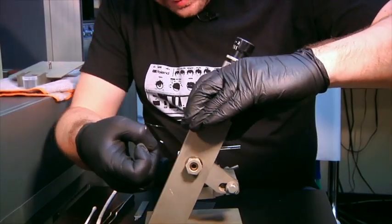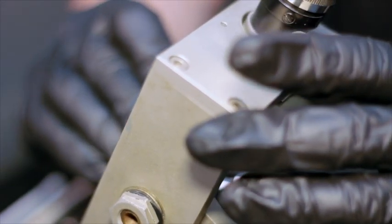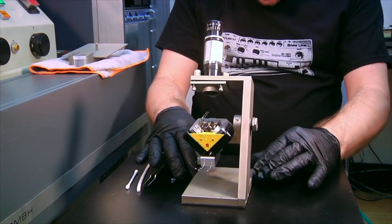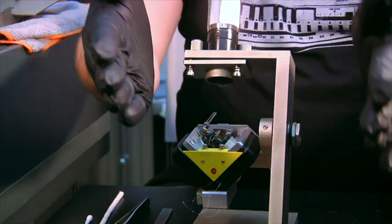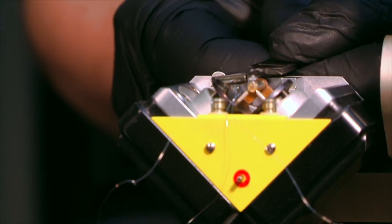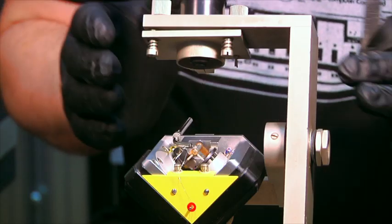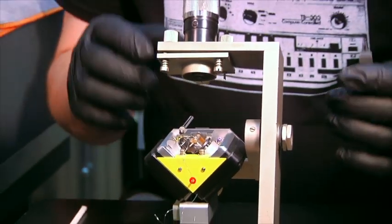On the Neumann, the heating terminals are in front. We're going to take this and just gently insert it into the torque tube. It's just gently seated in there. We're going to use our special tool to work it down in because these shanks have a taper to them — when you settle it in, that's what holds it in. You do not want to push down or apply downward pressure; we're going to work it in back and forth. Now that it's seated, I'm going to take a look at it through the scope and orient the facets.